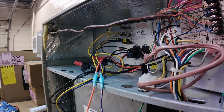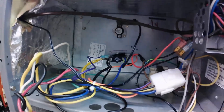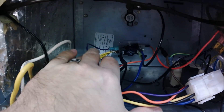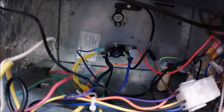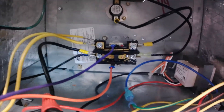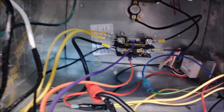Let me show a couple of examples of where we've done this. Leave the plug — don't take it and throw it away, leave it there for the next guy. Here's one: you can see the orange and purple wires again, and we've put a sequencer in place. Purple wire goes to 24-volt common, orange wire to 24-volt hot — works fine, it's just a sequencer now instead of the original Carrier relay with that little rectifier board. And here we've put a contactor in place of this one — a 5kW heater kit — works just fine. We're just using AC voltage instead of DC voltage for our control work. It's just a relay, nothing hard, but they do use DC voltages for reliability.